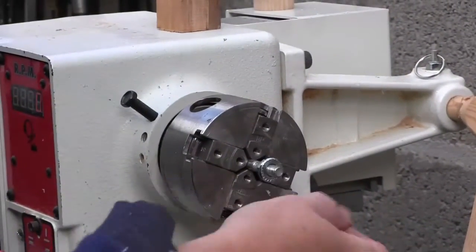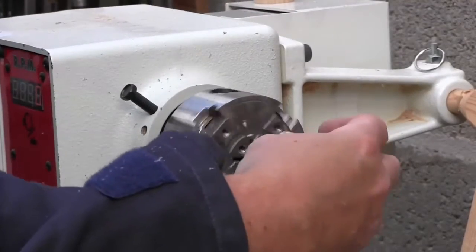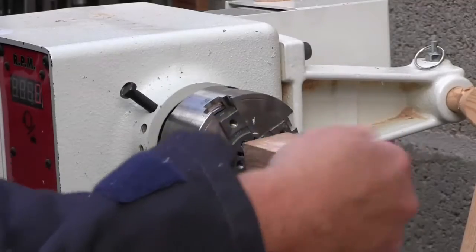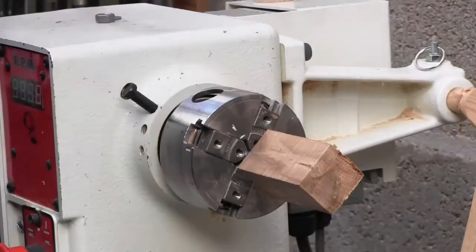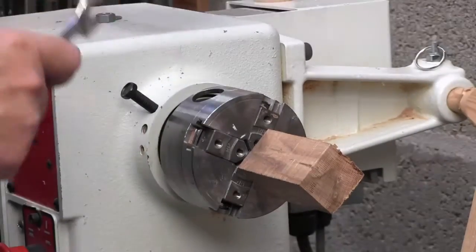So that will pop on there. You can use the washer if you want to, but alternatively you can just pop one of the blanks straight onto the flange head and tighten it up with the correct size spanner, which is 13 mils.